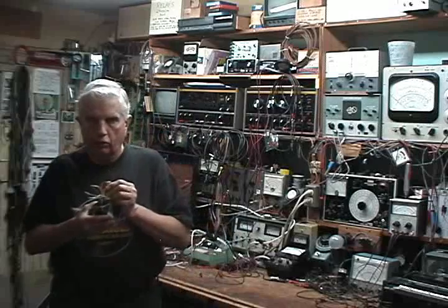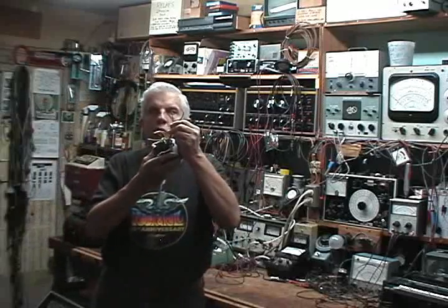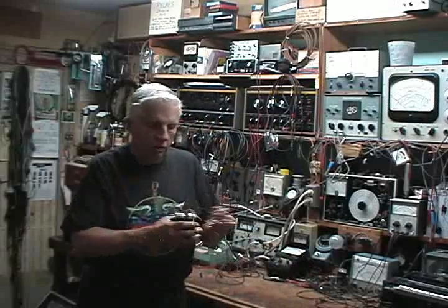Make sure the high voltage windings are disconnected — in this case the two red wires. If you've got other components on that socket, you're probably going to have filters going to it, so the best thing to do is disconnect the high voltage windings completely off the rectifier circuit so you just have the two wires sticking up. Disconnect all wires so that your transformer is basically running with nothing on it. You've also got to start out with a cool transformer, so if it's already hot, let it cool down for several hours. Then put in whatever input voltage it calls for — 110, 115, or 120 volts.